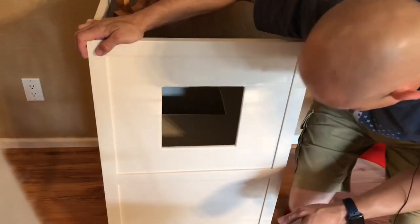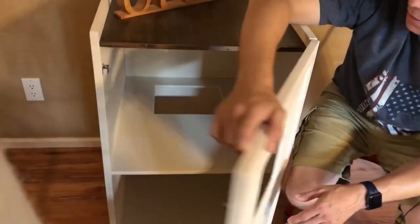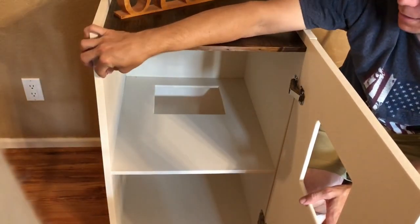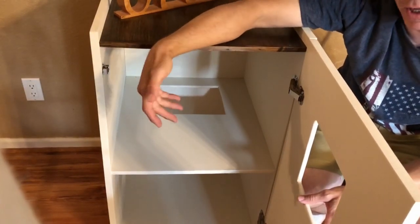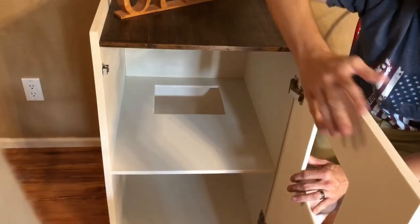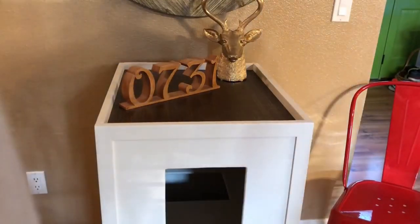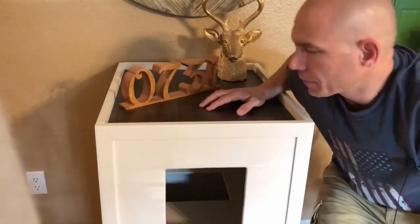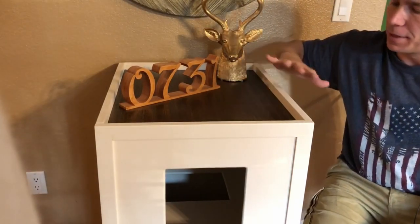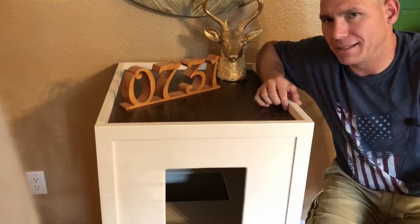This will keep the litter out of sight, and it's also dual purpose. We got this rolling latch here just to keep everything snug so they don't push on it and get the door open easily. We have concealed hinges so when it's closed, you don't see any hinges on the inside. On the top, we have just a shelf up here. The customer wanted this stained a dark walnut with a clear coat, and then the rest is a biscuit white — a farmhouse type paint scheme.